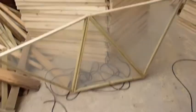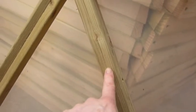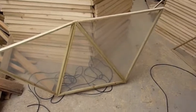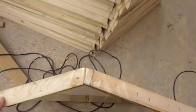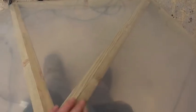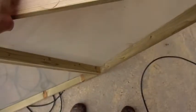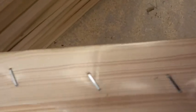So what we do first is we fix the frame together. Let me show you. There's a screw here. So we've screwed the single triangles together, these two sections together, these two sections together, to form, this looks a little bit like a half hex, it's actually not, but it's close. And then we cover the whole structure. You can see from the top, that's the curvature that we get for our dome, and you can see the film's covered here. It's nice and tight, and all we've done is we've pulled it over the sides. Let me see if I can get a view here for you. And stapled it to the edge,